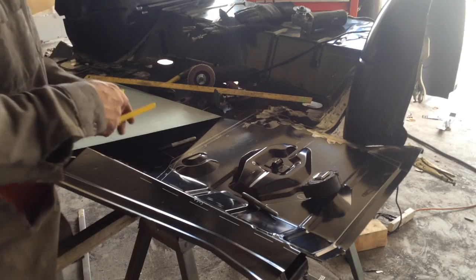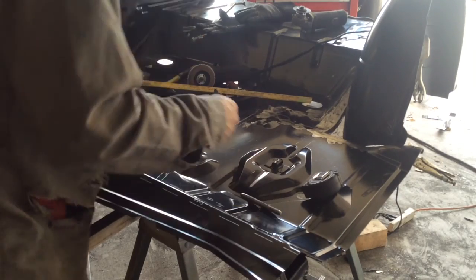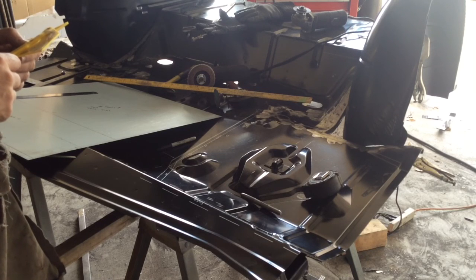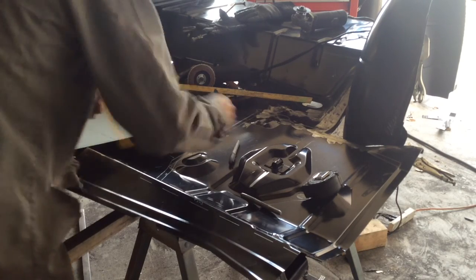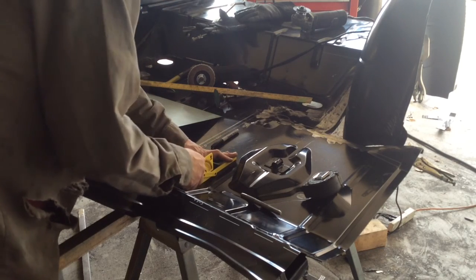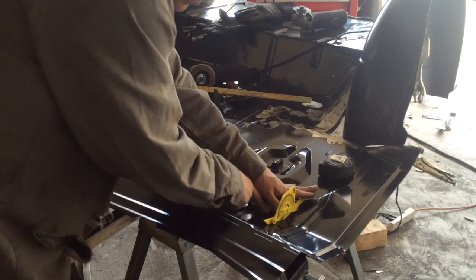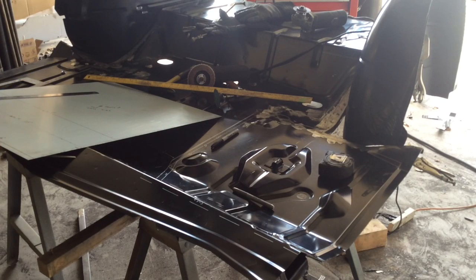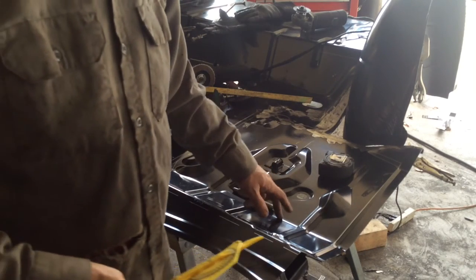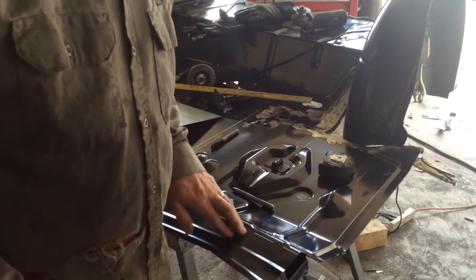I need angles on both of these. Looks like it's going to be 23 degrees for the first one. And here's the next one, which is probably going to be another 22 or 23 degrees. Makes sense, because then come up 23, up 23, up 45, and you get yourself a 90-degree bend up there. What I mean by that is, by this being 22 or 23, but both of these being roughly 22.5 degrees, this one being 45 degrees, this and this plane here are both level.